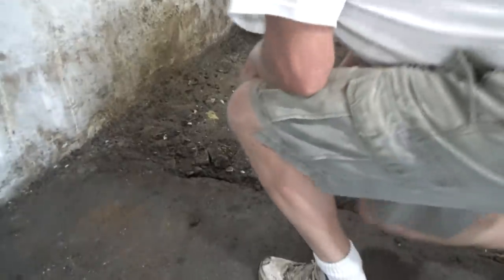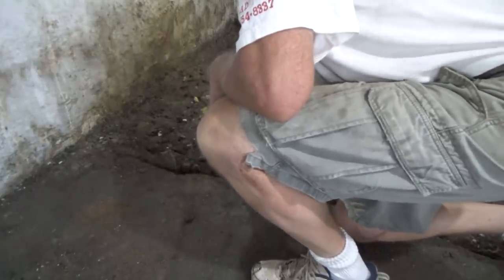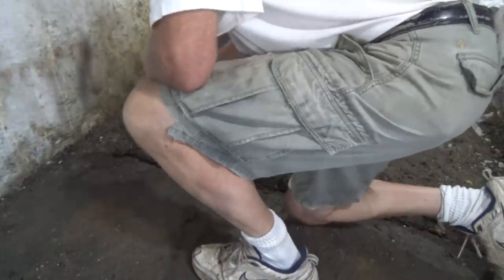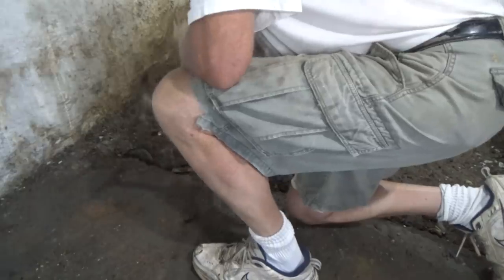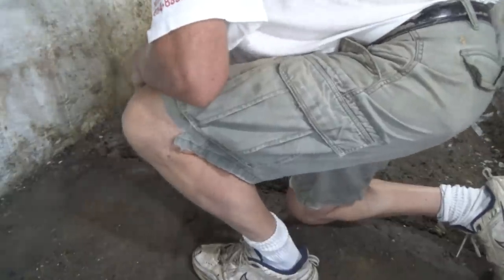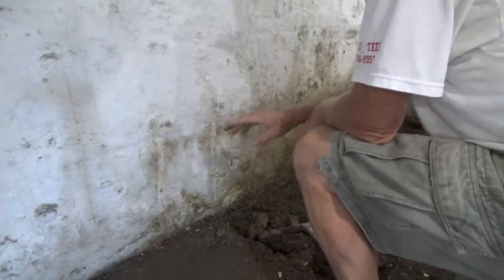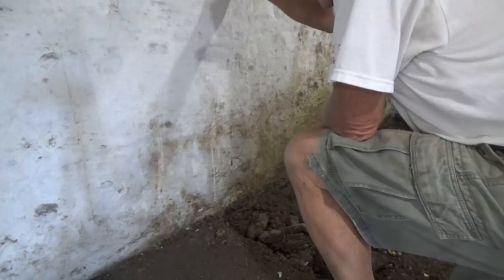Down the cellar, you just have to fill this in. The old timers, when they poured cement down the cellar, it wasn't very thick — they used a mortar sometimes, lime mortar. I want the cement to come up even with no overlaps, so I'm making it kind of straight. Right down in here, see this? That's where the foundation stopped. There was no footer in the old days, no rebar, none of that stuff. You just dig down and start your stone. This wall's been here over a hundred years.